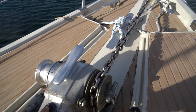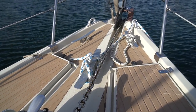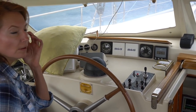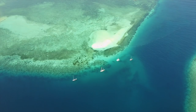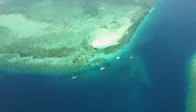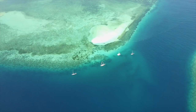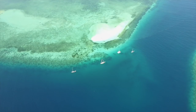Windlass: make sure you have a strong enough motor and that the chain fits it properly. They are nice to have when sailing shorthanded. Aquarius also has a chain counter so I can see from the cockpit how much chain I have out. When I am over the spot I'd like to drop the anchor, I try to set it on the ocean floor, then drift back slowly while letting the chain out slowly. Once I've reached about five meters of chain on the ocean floor, I put Aquarius in reverse and lay the desired amount of chain down. This job is so much easier with a chain counter.